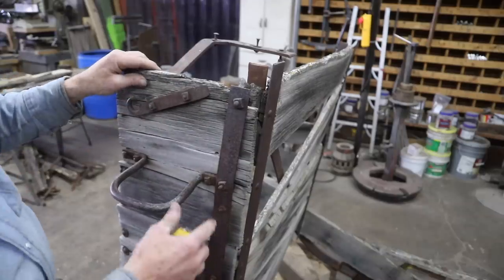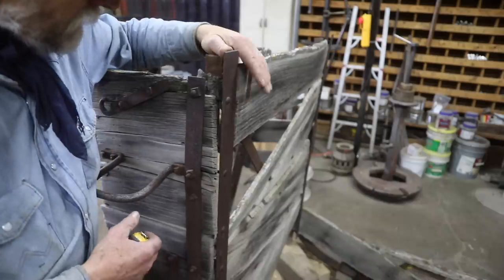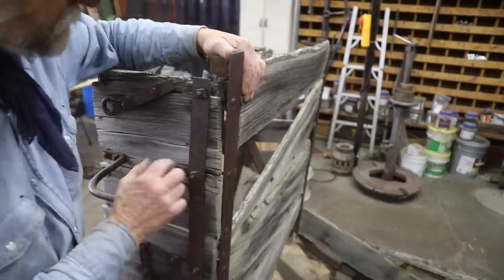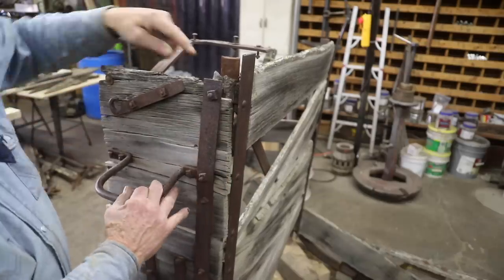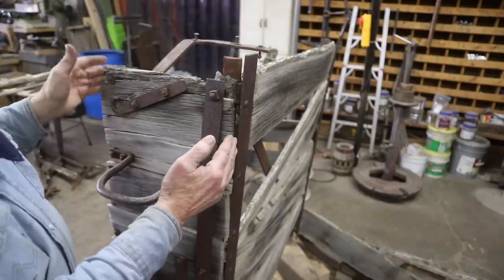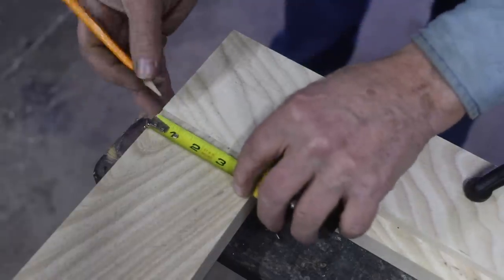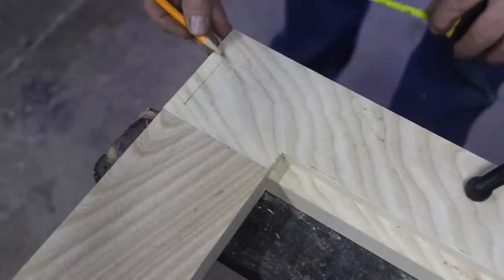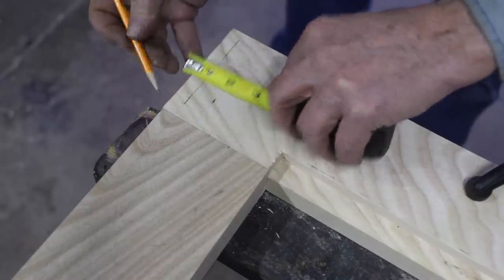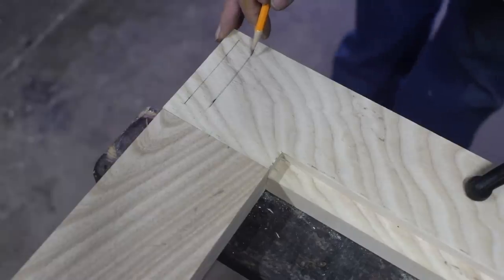So it seems that universal side to side, the width of these side box panels here are 14 inches. The rear panel of this box sets inside, so the back edge sits flush with the back edge. So if I'm 14 inch OD, I need to be inset on this inside framing 3/4 inch. So where I'm 14 here, I need to be front to back on these two frameworks at 13 1/4. So I'm going to allow 1/2 inch for this raised finish edge in the corner, and then 3/4 inch for the box side panel. So this will be 1¼ inches to the outside edge of my framing.